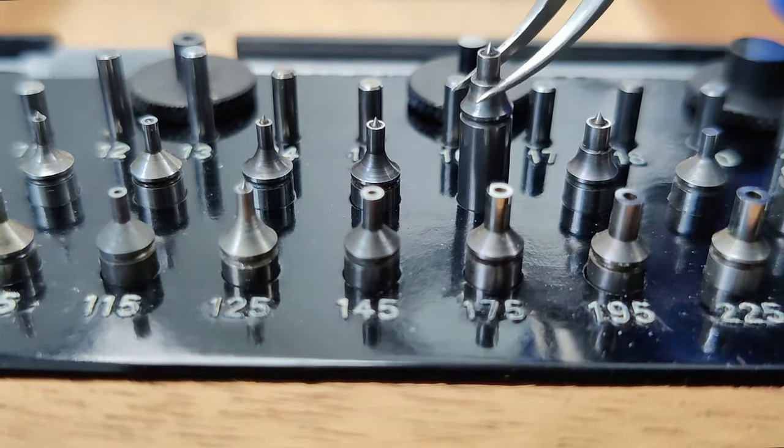here's the replacement jewel, which I pressed out from the donor using the same process. Now, unfortunately, as I was trying to fit this new donor jewel in, I realized that it was just ever so slightly too tall to seat flushly in the hole. And because we're dealing with such small parts here, there's really very little tolerance for error. So, having learned this lesson, I was a bit hesitant to buy another donor movement and just decided to pivot